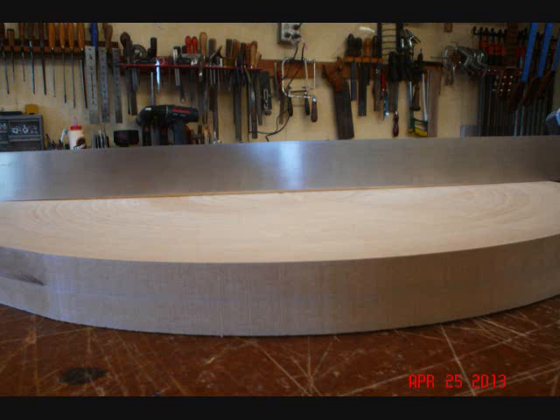This photo shows the end product that I'm after. The straight edge is placed across there so that you can see, although it's admittedly difficult, that there is a depression here. The radius that this is formed at is 40 feet, which means that the maximum distance between the straight edge and the center of that disc is something like 5/32 of an inch. So it's not really very much, but it still needs to be there and it needs to be precise.